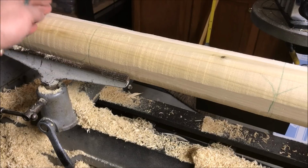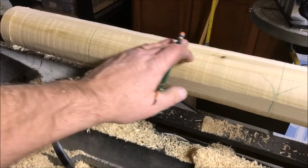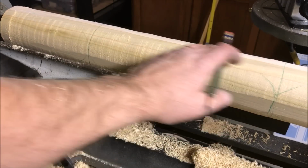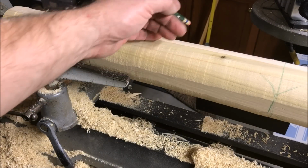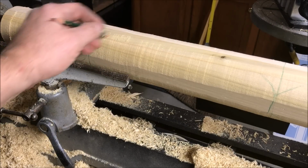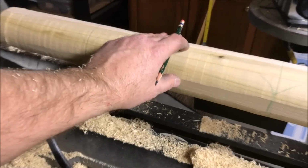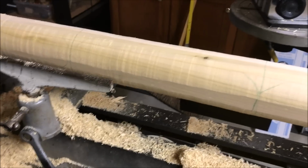So we'll round the head off and we'll flatten it. And I'm hoping to put a tenon at the top of the head so that I can turn a hat and slide it onto that tenon to hold it onto the snowman. Now, the reason why I rounded the corners but I left the flat areas on this blank is because instead of arms, the snowman will have hooks to hang stockings on. Around his neck will probably be a little scarf, and then there'll be some hooks below the scarf, three of them, to hang our triplets' stockings.